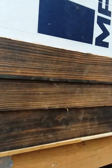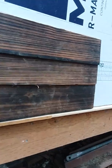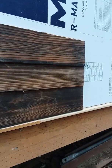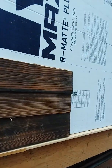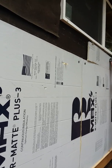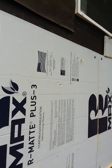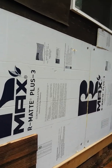This is what the siding is going to look like up to the window height, and then we'll switch to the cedar shake, just like we're doing on the door. I'm really excited to get this little mock-up out just so I can take a peek at it and see what it's going to look like in the real world — I know what it looks like on my drawings and in my mind, but this is how it's going to roll. I'm really excited to do this to increase the energy efficiency, because we'll put rockwool in the interior of the wall cavity and it'll really keep the room at an average temperature — whatever we determine is good working weather.